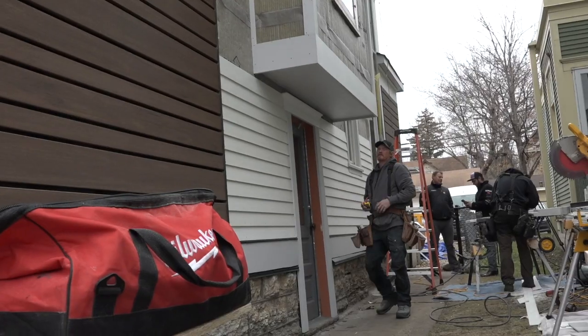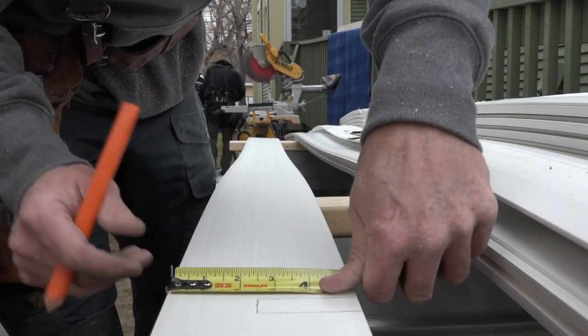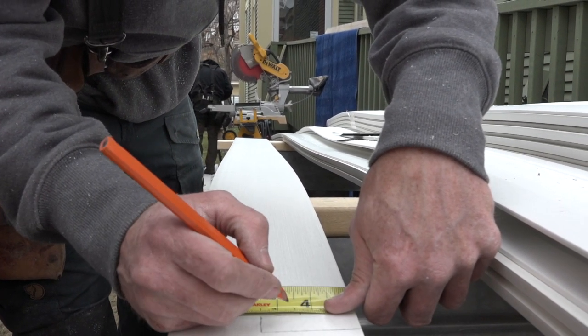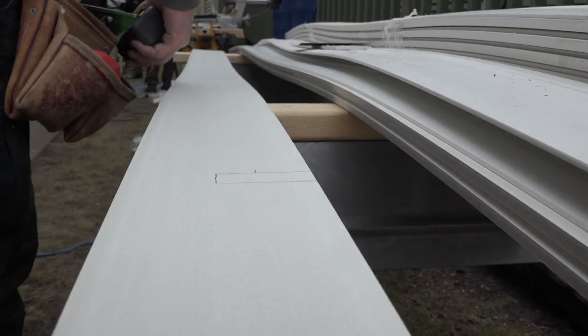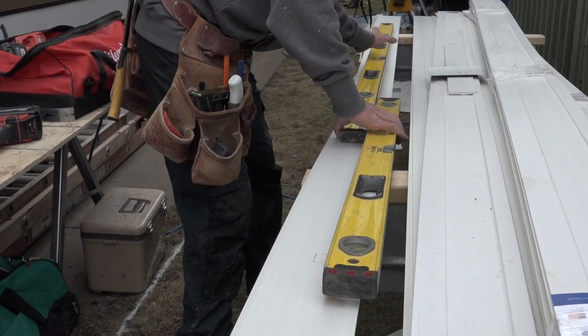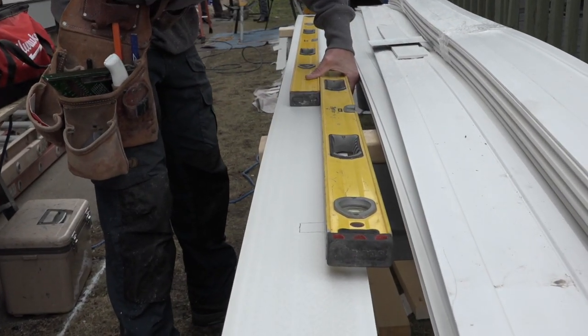After double-checking to make sure where he ends is where he thinks he's going to end, Saul strolls back to the workpiece to draw the cutouts between the reference marks. A section is cut from the top of the siding for the bump out, and a section is cut out of the bottom of the piece to notch over the door. If he had a flat work table, he'd probably use a chalk line to snap this, but instead he draws it with a straight edge and a sharp pencil.